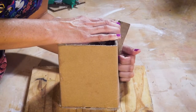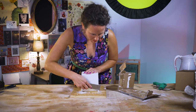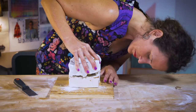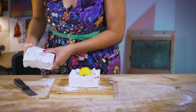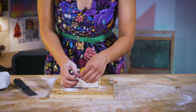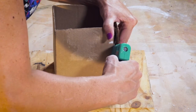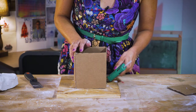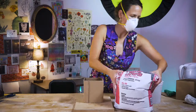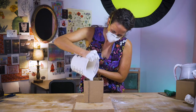Remove the mold box. Clean up the edges and smooth out the bottom. Gently remove the clay — be careful not to remove your object. Replace the ventilation wire with your object in the plaster. Hot glue the cardboard mold box around the first side. Coat the inside of your mold box with Vaseline. Mix the plaster and water in a 2 to 1 ratio. Pour plaster in the mold box.